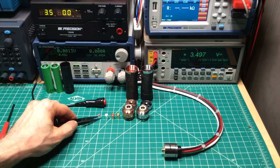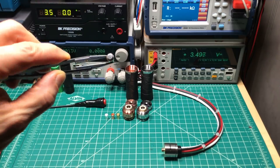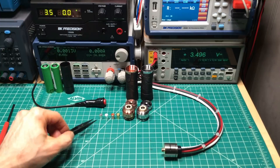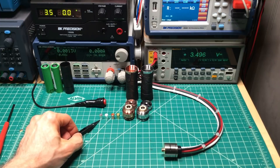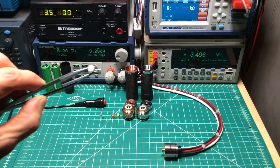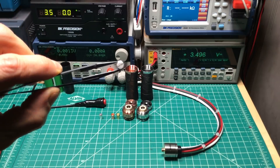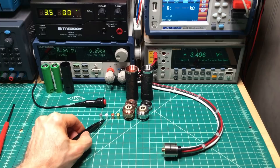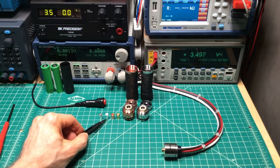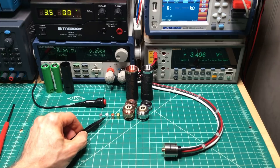I had measured the resistance of the pins. The flat one, which is not installed when you get it, measured about 13 micro-ohms at 30 amps — that's less than one-half of one-thousandth of a volt drop through this. The multi-point pin tested out at 39 micro-ohms, which is three times the resistance. You might think there's no way you're using the multi-point, but three times almost nothing is still almost nothing.